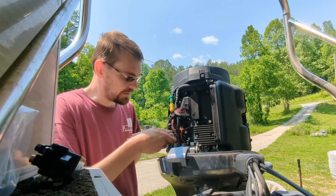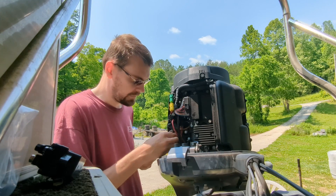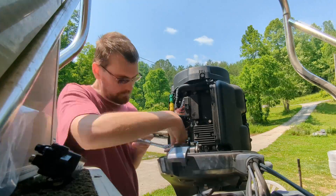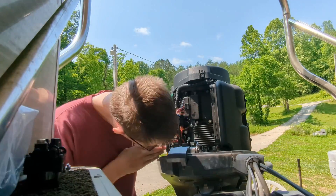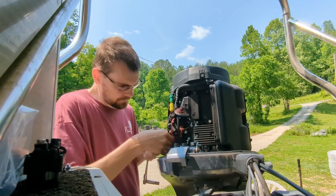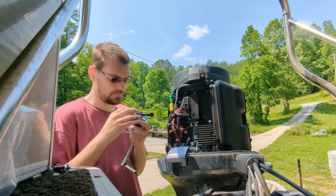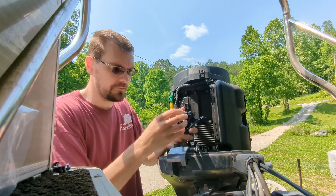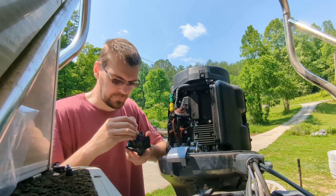Replacing our trim relay is pretty simple. We're going to disconnect our white and black wires that go to the motor — we need to remember which position they're in. Our white is up here and our black is down here; otherwise, the directions will be reversed when you go to run the motor. There's our old relay removed. Grab our new relay, which is color-coded, although we do have to rearrange stuff a little bit because this is set up to have a positive lead that comes in, and this motor has a positive lead with two connectors.